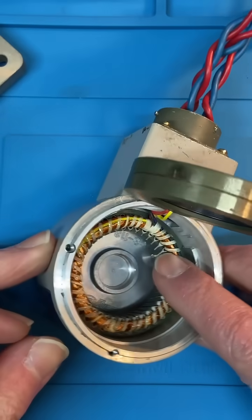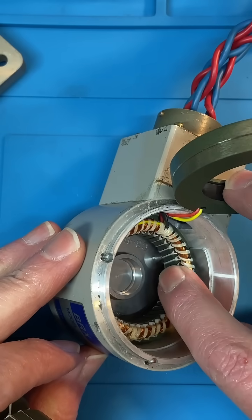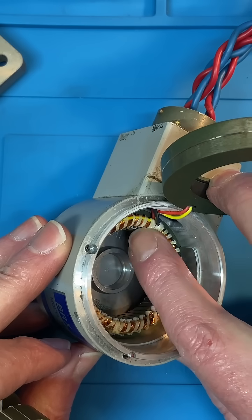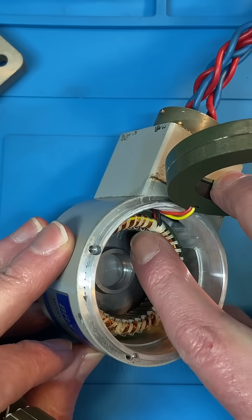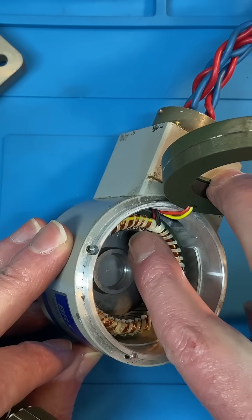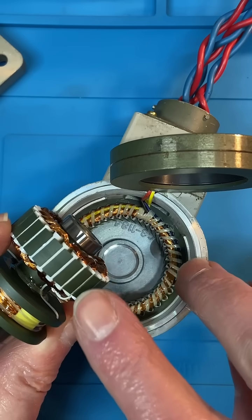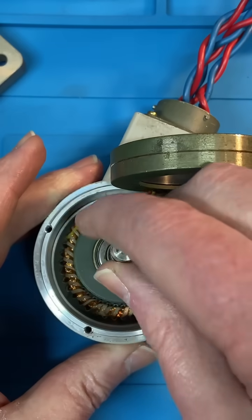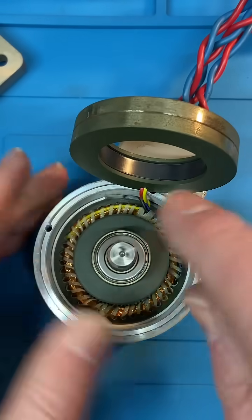In here is your secondary — this is where your power generation takes place. There's either one winding in the case of a single phase alternator; in modern alternators you have three windings for a three phase alternator. In this case there are two windings — it's a two phase secondary. If you were to intercept what's coming out of here with a rectifier and spin it, this should work as an alternator.